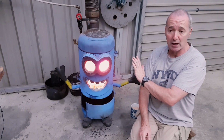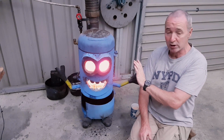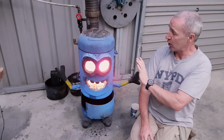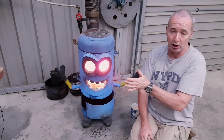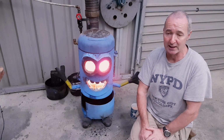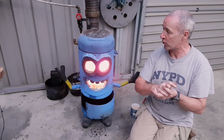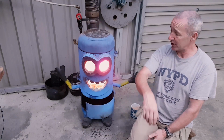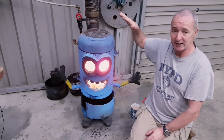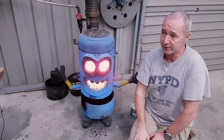So we've no moving parts in this. You can hear it. It sounds a bit like a rocket stove, and it works a bit like a rocket stove as well. So I'm burning about 2 litres of used oil an hour. 2 litres, that's half a gallon or so. American gallons are a bit different, but it's 4.54 litres in an imperial gallon. So you can kind of work it out off that. But this thing is going to get too hot to sit beside now. It's already beginning to do that, which is fantastic.